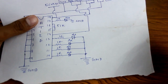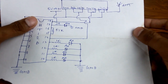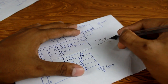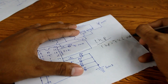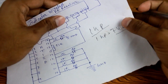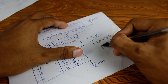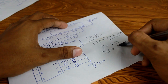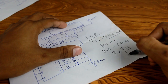Now if you want to use a water pump with this setup, you have to modify this circuit. Suppose you have a 1HP motor — 1HP means around 746 watts. This is a single-phase motor. To handle this circuit, since P equals V times I, the power is 746 watts and the voltage is 230 volts, so the current will be 746 divided by 230, which is around 3.24 amps.